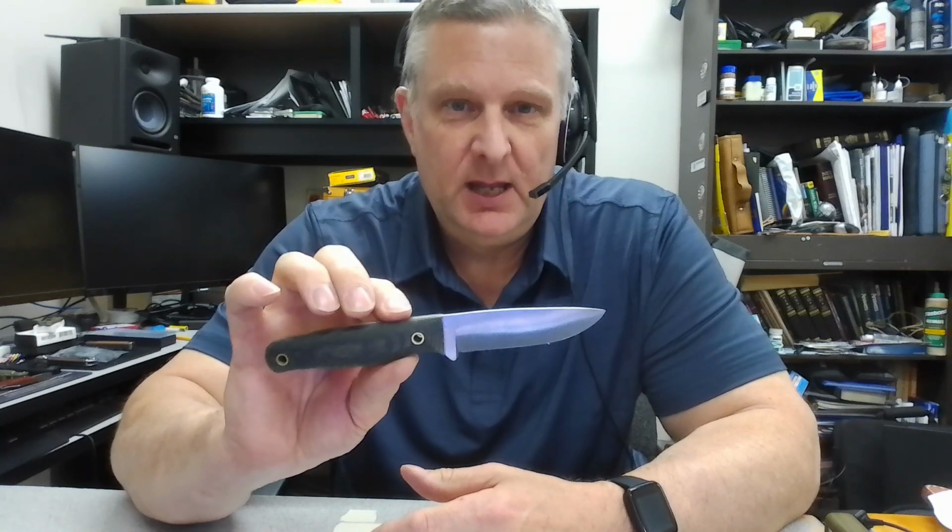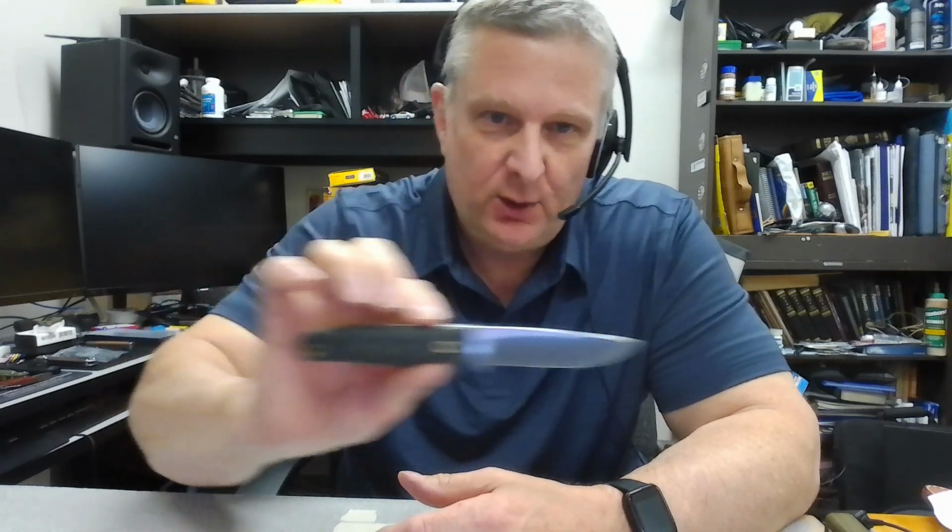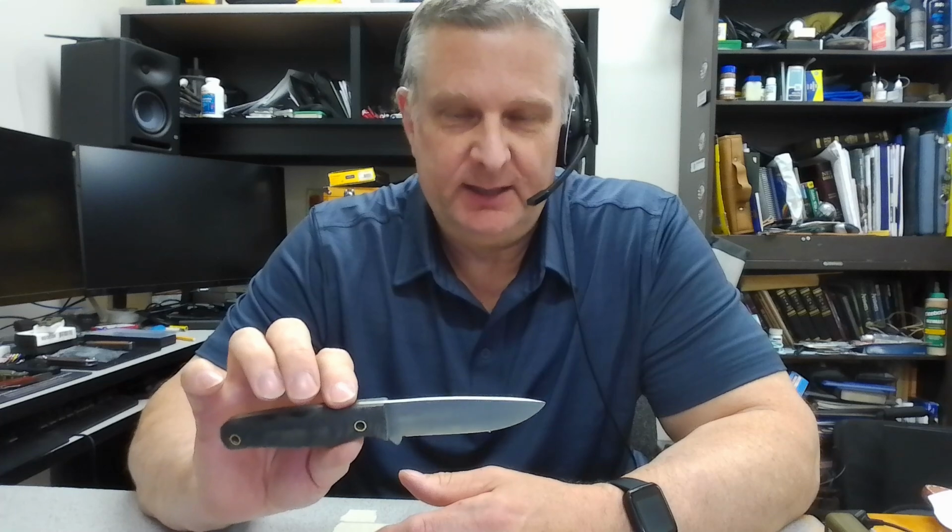Sharp, technically a polished blade is going to be sharper than what this is, but they'll actually slide over a lot of materials without digging in. You can take a sharp polished knife and have it slide over a tomato, and if you have to put downward force, you'll crush the thing. You can also take that same knife and try to cut a piece of rope, and it'll slide right off the piece of rope without cutting it, especially a nylon rope. A natural rope is going to be a little bit more likely to cut.